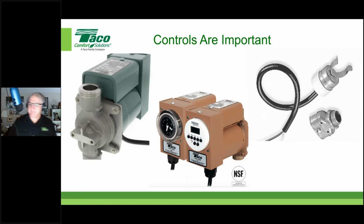Well, like you'd mentioned, on the return side of the circulator, but ideally, if you can get it out just at the farthest fixture group, so when it sees the temperature drop there, it brings the circulator on rather than waiting for it to get all the way back to the mechanical room, which is typically where these would be installed.